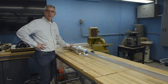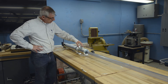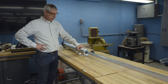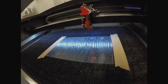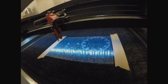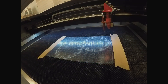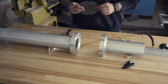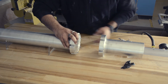This is a pressure tank made out of aluminum pipe that's been TIG welded onto this fitting here. There's another fitting, and this can right here has the nozzle in it. The nozzle is 3D printed to a very specific shape. Right in between them there's what we call a burst disc — this is a laser multi-layer burst disc that Raj designed. We've got so many bolts on it because with 125 or 150 PSI, when you figure that over the cross-sectional area, that's actually a lot of force, so we have to resist it with these bolts.